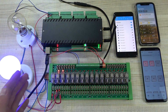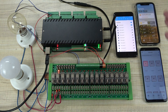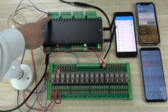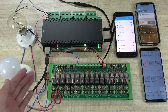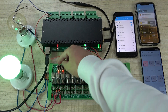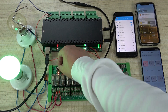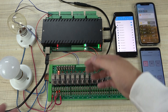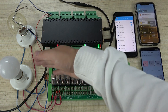You can use a pump or large current load that will be turned on this way. When I press off, the voltage becomes zero, so the relay has no voltage and turns off. This works with Apple HomeKit and Home Assistant simultaneously. If the controller is bad or the line is broken, you can use the manual control button to turn on and off — it connects directly by hardware with no software, physically connecting to the relay directly.